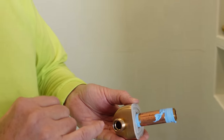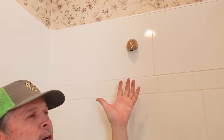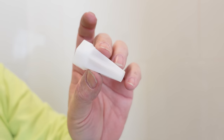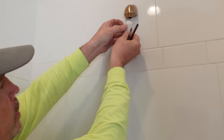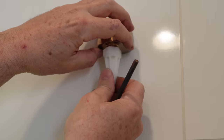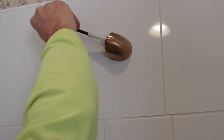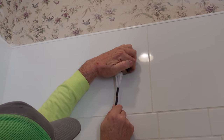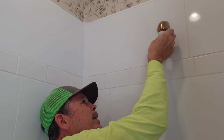This actually came with a special tool to take the place of handles. Let me get it started and we'll show you what it's all about. It's hand tight, and I'd like to get at least one, but ideally two more turns on that. This kit comes with an installation tool — at first I thought it was some kind of nozzle for high pressure. The end is designed to accept a quarter-inch allen wrench, and it's an installation tool to help you tighten this without putting a tool directly on the fitting and damaging your finish. I tighten it and put the allen wrench in there for additional leverage — two more turns. Now let's take this off; we're ready for our next step: drilling into our brand new tile.